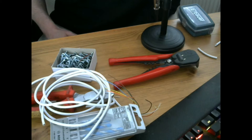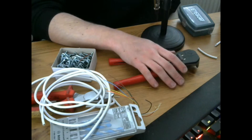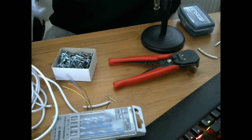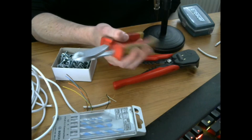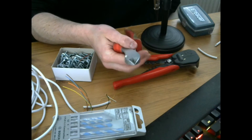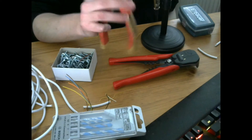Another thing I would recommend is different colour tape, so you can mark out different places for the panel. Also, the side cutters we looked at are quite large and bulky, so if you are doing a big panel your hands will get tired. The best thing to do is get some smaller ones with a spring open, which will enable you to strip back cable quicker.